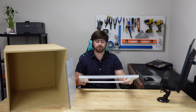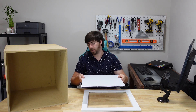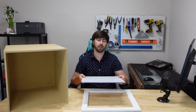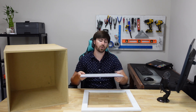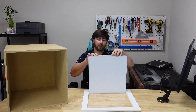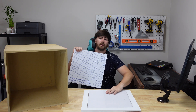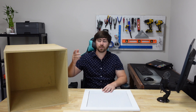If you end up splitting or damaging your panels, you can always use wood filler to cover that up. If you decide to add a window to your enclosure, I recommend using a jigsaw to cut out the frame, and I recommend using polycarbonate sheets — polycarbonate is much easier to cut than acrylic and can be cut with a table saw or circular saw. I chose to insulate the window using two panels of polycarbonate, one panel on the bottom and one panel a quarter inch higher, leaving an insulating air gap.